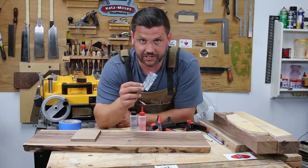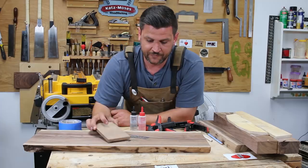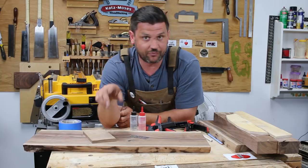I'm going to start by gluing the abalone to the walnut, then cut out the key, trace it onto our slab, router it out, fine-tune it, and hammer it home. Let me show you how I'm going to do that.